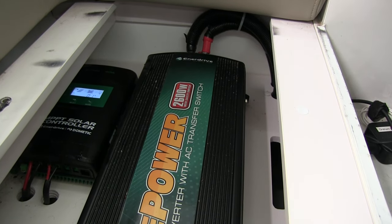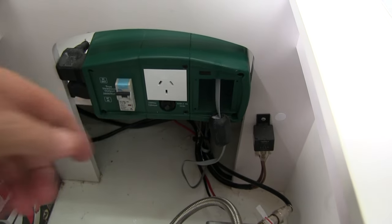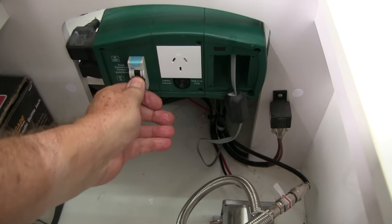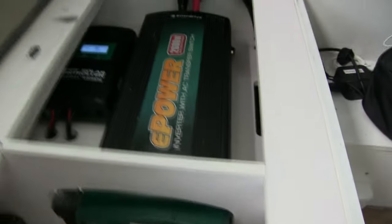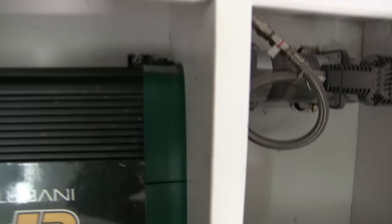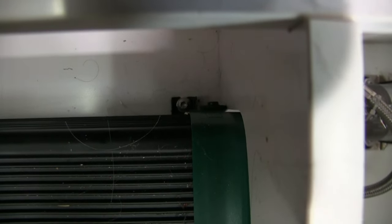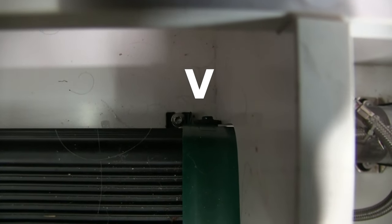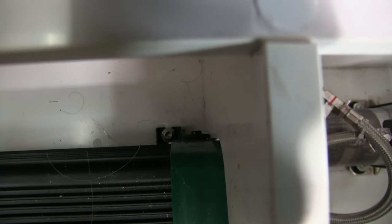If you're using inverter power, look on the end of your inverter — there's a circuit breaker to see whether it's in the on or off position; it has to be in the up position. There is also another reset on the inverter — down the side there is a black reset button that can pop out. A firm push and it'll click back in. That covers the main steps for restoring lost power quickly.